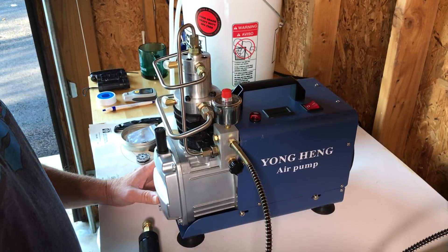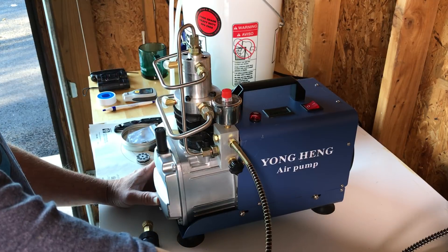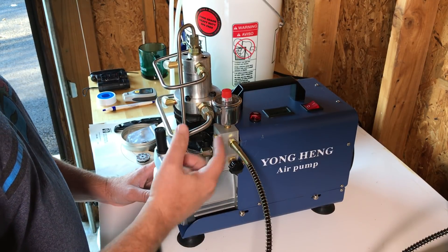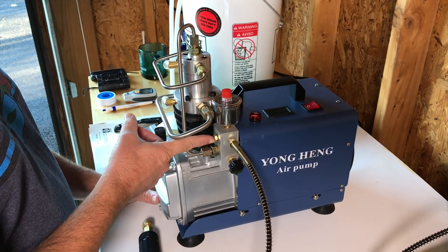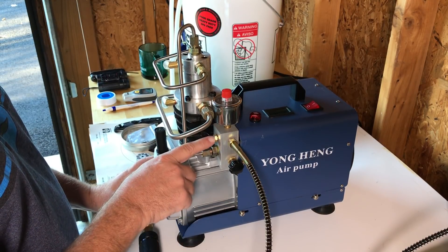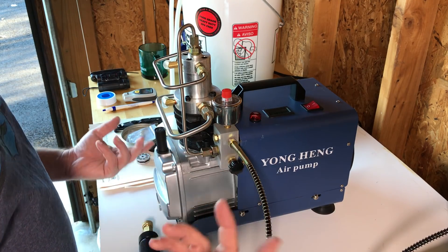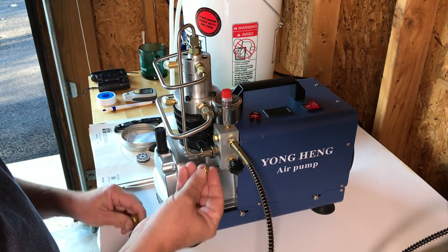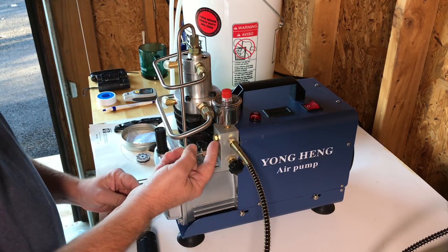Basically what I think happened: in my new tank, I don't think the pressure regulator is super accurate, and I think it got up above 350 bar when I was filling it for the first time. Right around when it said it was at 300 bar, this fitting right here started leaking — not a crazy blowout leak, but a constant steady stream. I took it apart and looked at it but just couldn't figure out what was going on because it looked like a normal plug you'd use to pressure test your line, but you could tell something was going on with the fitting.